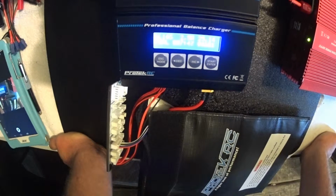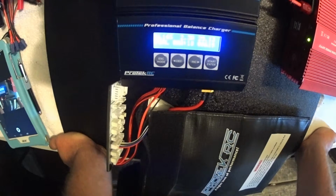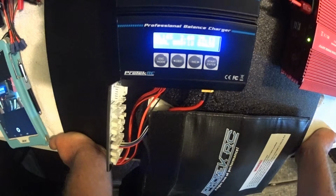For some reason in the past, I decided I didn't want to mess with 12 volt anymore. I wanted the efficiency of high voltage, so I ended up getting a 24 volt. Actually, no, it wasn't Feather Merchant. It was from, I can't remember where. Anyways, I got one of those converted power supply servers that was 24 volts. And then I ended up getting two Thunder Power 1527s, which are 27 volt, and then I can put them in parallel, because it's 550 watt each power supply.